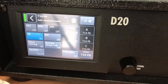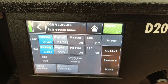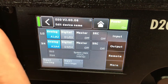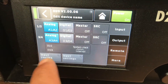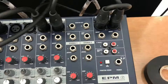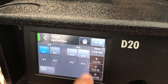I will show you how I have configured them on the screen. Go to home — this is the main page. Click here and this is your input section. Select analog because I am not sending any digital audio to the amplifier. So I have selected inputs as analog audio. Go to input routing and make sure wherever you have connected your left and right from the mixer — I have connected to A1 and A4 — they are routed properly to the corresponding outputs.